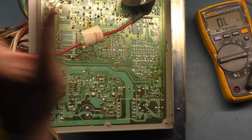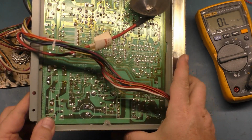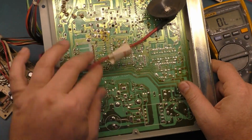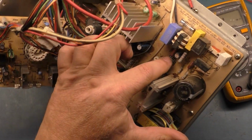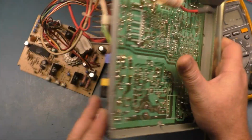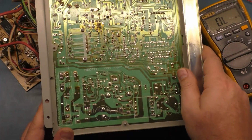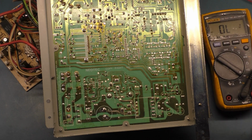All right. I don't have my fan going or my extractor. I should have my extractor on. All right. Well, that is not the problem. So in that case, it's most likely our switch mode power supply chip. This guy right here, like I thought it was the first time on the first 2501 we worked on, because that one was dead as well, dead as a doornail. So let's check and just see if we have any odd readings.